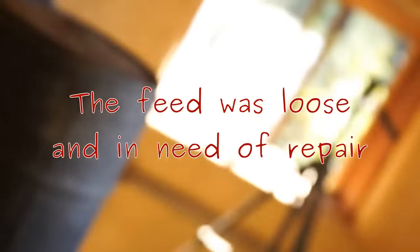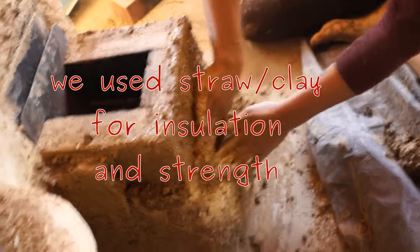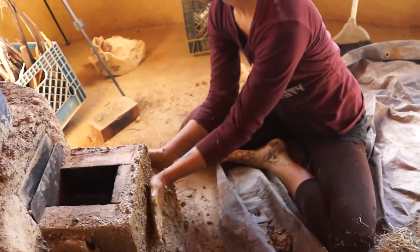Really wet, really really wet, soaking wet - like not wringing it out. Don't wring it out. And then put it on as long as you can, pet it out as long as you can. You don't want little blobs, you want straps. Then pet the straps. It's not going to be like cob - you're going to go around the corners with them. Put them around the corners first, really slick them on. Imagine you're strapping it down with tape - you're taping it on. That's actually a good analogy.